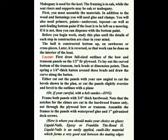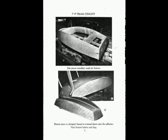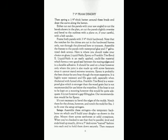Frame both panels with 3/4 inch thick hardwood. Note that the notches for the chines are cut in the hardwood frames only, not through the plywood bow or transom. Assemble the frames to the panels with waterproof glue and 1 inch galvanized deck screws. Here is where you should make a choice on glues: liquid nails, epoxy, or Franklin Tight Bond 2.